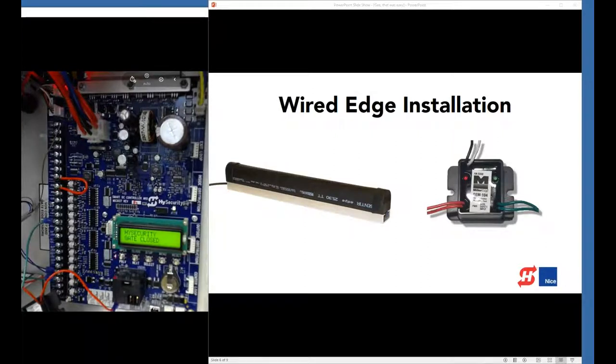I can use the same photo eye align trick to bring power up to the GEM 104 and test it. Menu twice, go to photo eye align — it switched itself off after the last full gate cycle — hit select, next to turn it on, select to save, and menu. Now you can see the LED next to sensor 2 is lit, indicating it's working. I squeeze the gate edge and the light goes out, then release and it comes back on. That is definitely working.